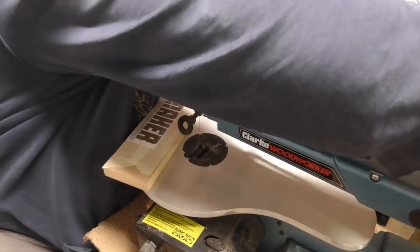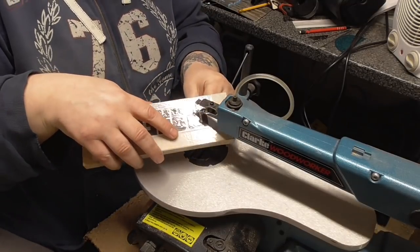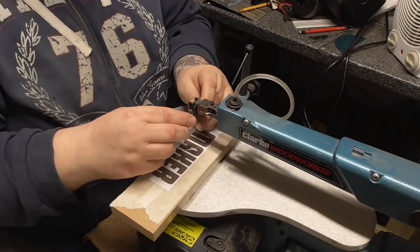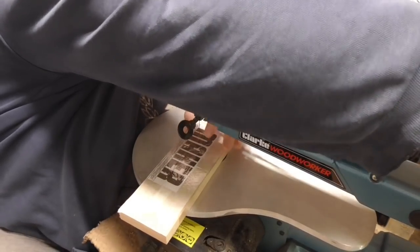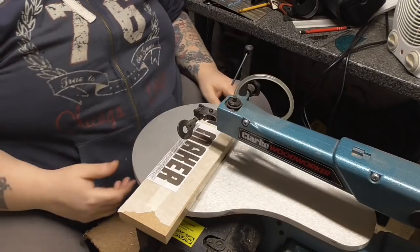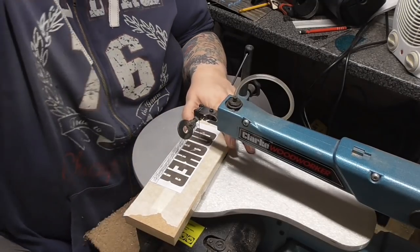So I'm just going to slacken the tension off. Feed it through the hole on the back of the work. It is a bit fiddly. Set your tension again. You'll know as you get more experienced where your tension has got to be each time without listening to it. So I'm just going to set my machine on a slow speed. I'm going to make my first cut.